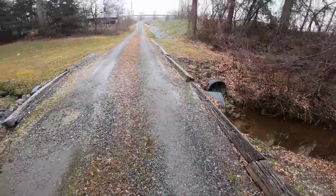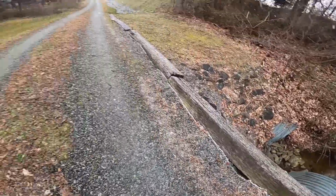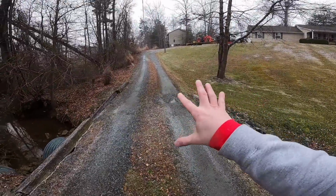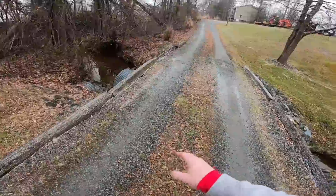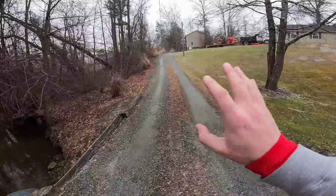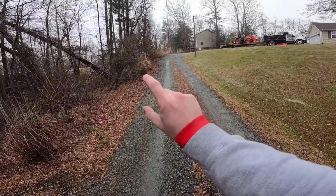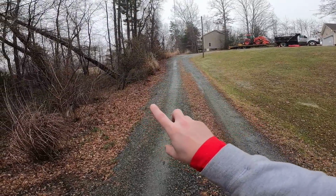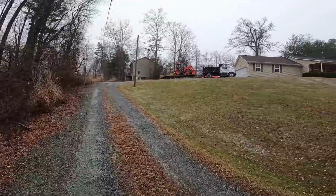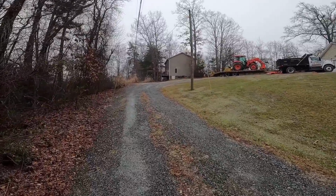I'm gonna pull. Really, I don't have to pull these ties. You can see the water's worked its way under here. But I'm gonna dump 6 of my truckloads. So that's about 48 tons, starting right here where the problems start, and that'll be enough material to build the road up. I could just tailgate stone down and grade the stone, but it'll make thin and thick sections of road bond. I want it uniform. I want this whole road dome shaped. So I'm gonna unload my tractor, stick it in a corner, and then we're gonna take off out of here.